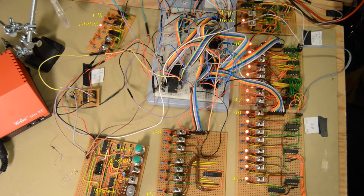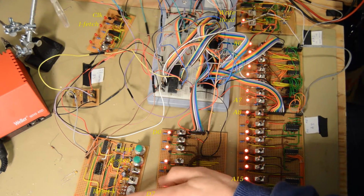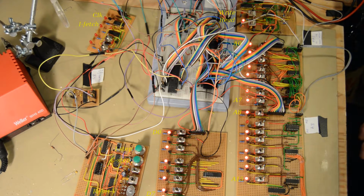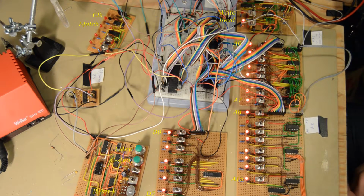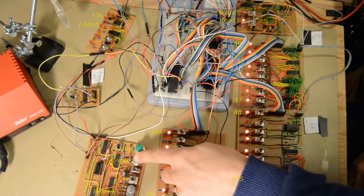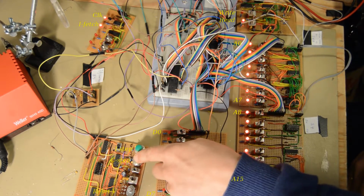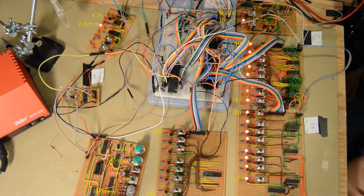Now the system is completely uninitialized, so let's take a look at the reset sequence. So now just the CPU is reset. The memories just contain garbage. They don't have any defined values. But let's step through the reset sequence. So I will use the clock stepping here, and I'll press it once and twice, and the second time I press it, the instruction fetch lights up.